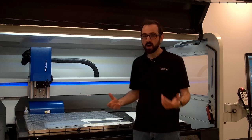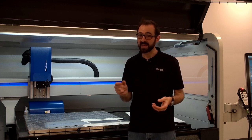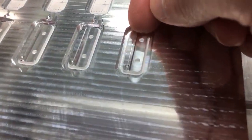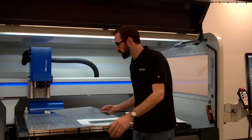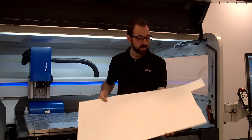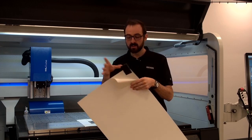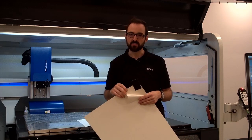But what about small parts? We get this question even more often. How small of a part can I hold without cutting it out? The answer is actually quite small. I personally have held parts about a quarter inch in diameter on our vacuum table. The key is how tall the part is. With thin sheet material it's quite easy to cut small parts out. The taller the material, the more leverage it has to tip over when cutting. We also have variants on our VacuCard: plus-plus and plus-plus-plus, which are paper with an adhesive backing so you can tack the part down, adding lateral grip to keep it from shifting when cutting out.